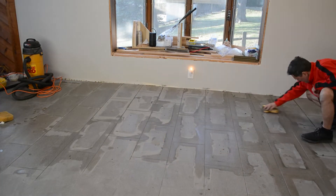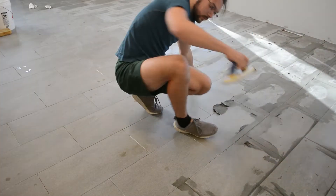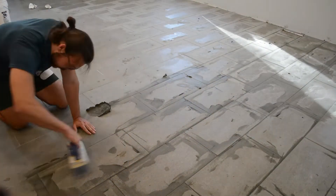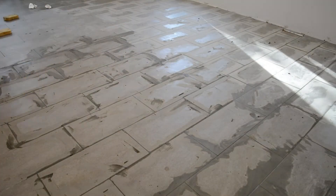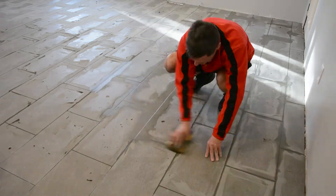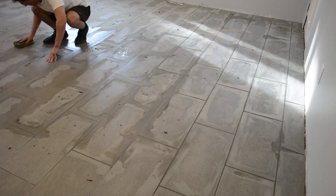You've got to have a good eye for it. When you do sponge, you kind of want to become Mr. Miyagi and do a little bit of wipe on, wipe off action, as you don't really want to rub around the grout too much. Once you wipe it up, you want to directly rinse it into that bucket of water because you really are just spreading around more grout all over the tile, causing more of a headache and more clean up later down the line.